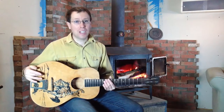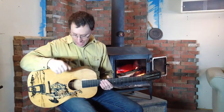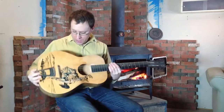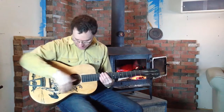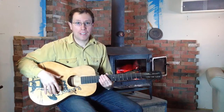Now to flatten this top, it took me 2 hours of literally using a clothes iron and a steamer. I steamed the back and kept flipping it back and forth to make sure it wasn't melting the cowboy, the Bucking Bronco and the finish. And I was actually very surprised. I managed to get it flat.